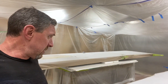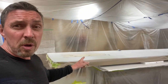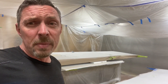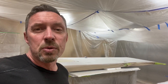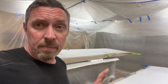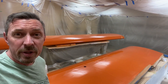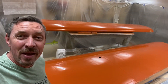What I'm going to do next is flip both wings over and do the top side. I'll get this one done shortly, and when my son comes home we'll rotate the other one over. I'm going to have a join mark — most likely it will be visible, but I intend to have it just on the top of the leading edge, which will be out of sight for most people. I spent a couple of hours this morning with red Scotch-Brite preparing the primer, gave it a wash down, went over it with tack cloth, and then put on the orange colour — that seems to have come up all right. It's not 100% perfect, but I've got a bit of a tolerance for imperfection. Overall pretty happy with it.